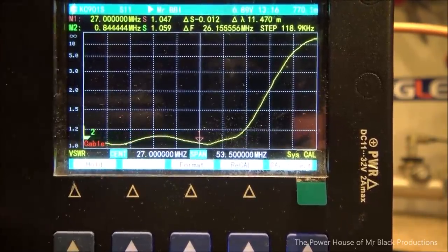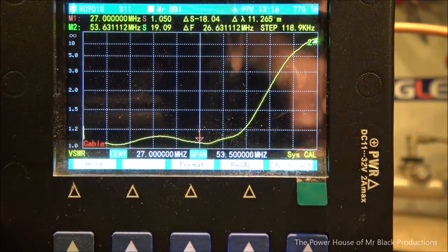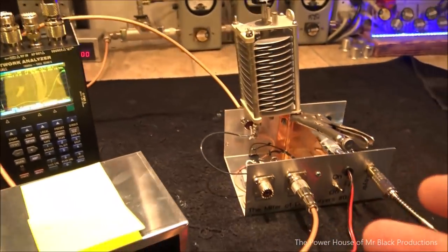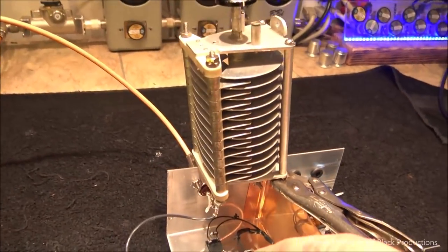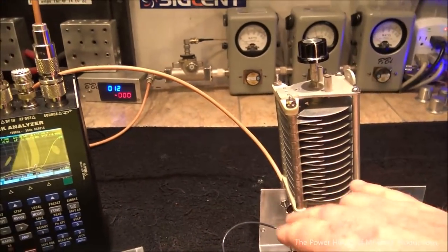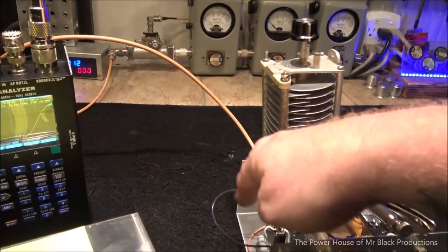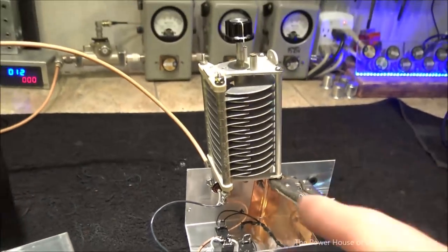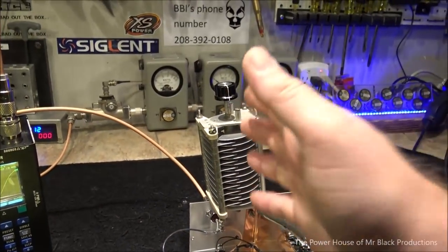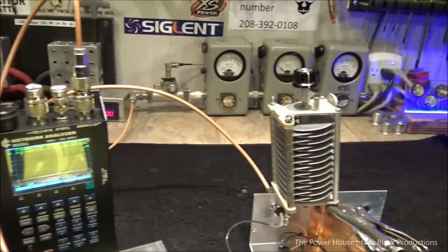is we go ahead and mute this thing, tell it to stop pulsing RF down through the signal. And you can do this with a grid dip meter, by the way. You don't have to have like an MFJ 259B, whatever. Now that that's off, I can go here and remove this wire, and measure the capacitance from here to ground, make a calculated adjustment, because remember, there's this induction here. Then I can add a capacitor from here back to ground after measuring this value, which I bet is going to be somewhere in the area of about 50. And then we can reevaluate, and I bet you it'd be pretty darn close.